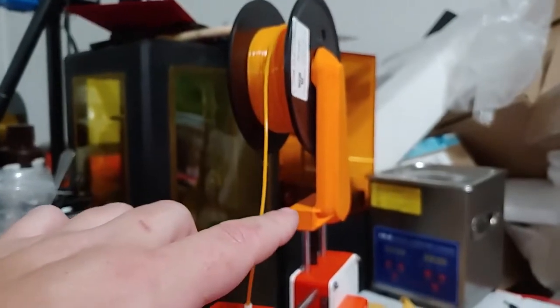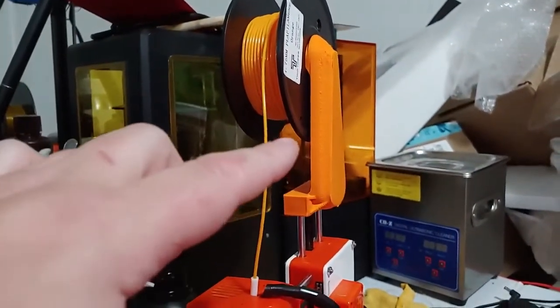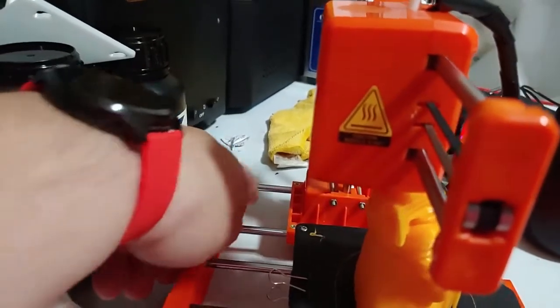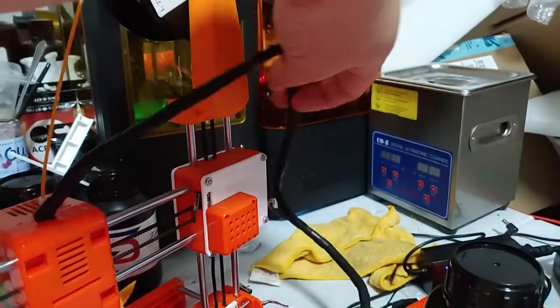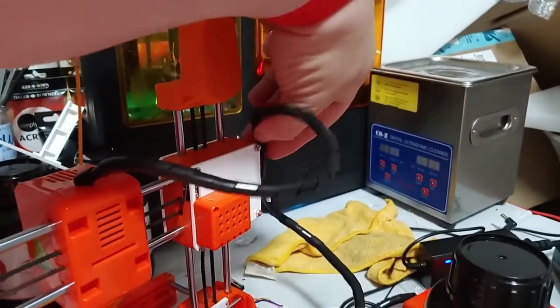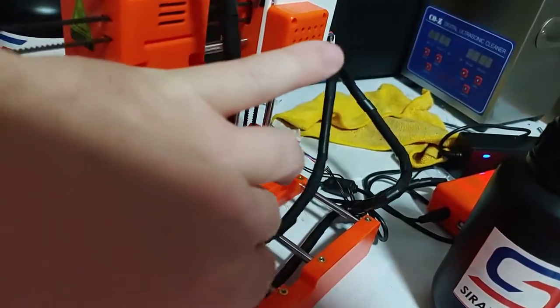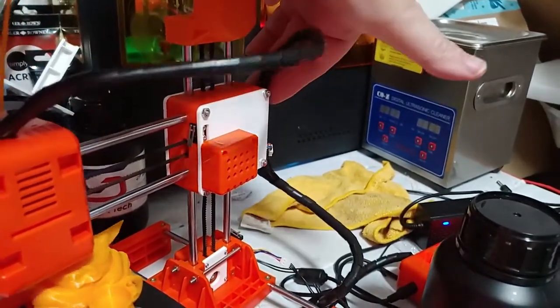I designed a new spool holder — this will be on Thingiverse, link below. This spool holder prints without support in one piece and works a lot better; it just pops right on top. I'm also going to attach a little block so that it can be popped off and mounted, because I want to make this portable. Another thing I need you to do is add a clip here to attach the cable like this, because as you can see it gets in the way of the bed. I've had this snag a few times — it gets down in here and snags. At lower Z heights this will actually snag on the bed, so simply having a clip back here to attach this fixes that problem entirely.